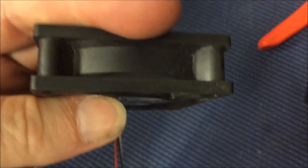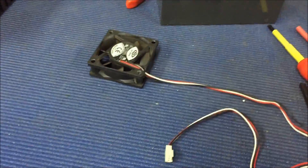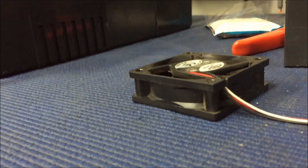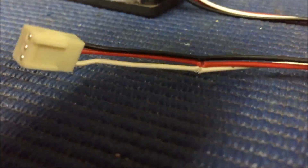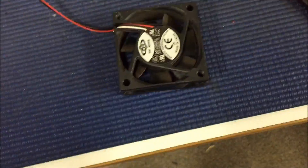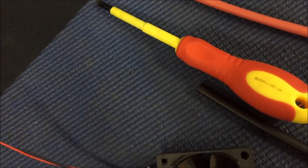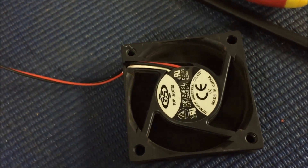I'm going to try and fit a used fan. Usually they've got arrows on them - this one doesn't. I've got a battery there so I can just test it. Cut that cable off, cut the plug. I didn't cut it all the way through. Okay, so the cables are cut. I cut the white one off because that's a thermal - does temperature. Touched on that and it spins, so that fan works.